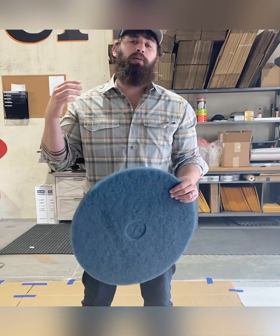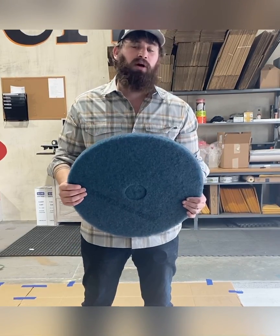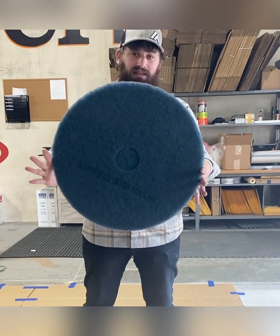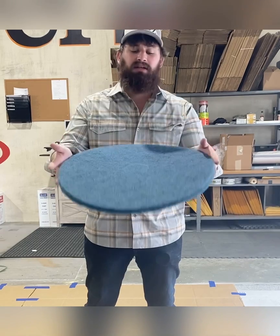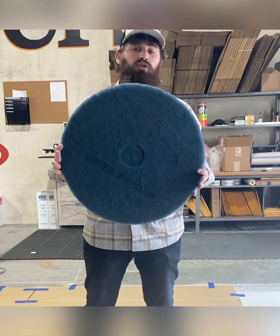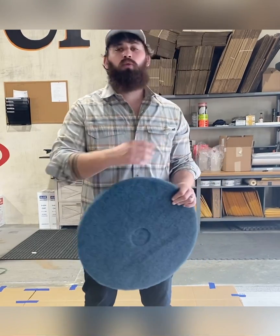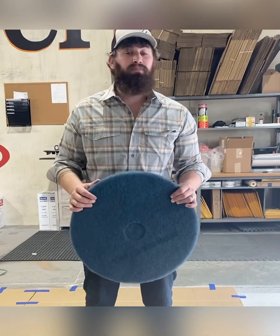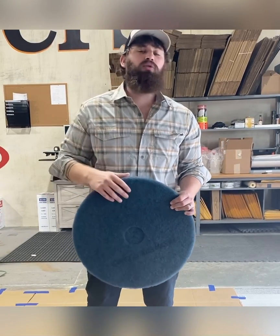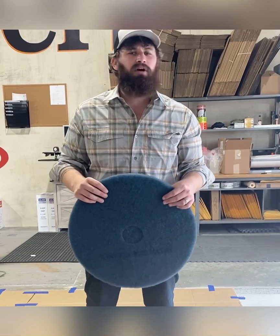So if you go and put our product down over it, you have to stunt that emissions process by cleaning it effectively, okay? If you take this teal blue pad, it still has a little bit of an abrasive tendency, but it's not going to hurt your epoxy, okay? So what you're gonna do is let that critical recoat window close up. Technically, the longer you wait, the better your BallistiX is gonna go down. But we understand that you guys can't always wait, right? You can't tell your customer, hey man, wait 4 or 5 days and I'll come back and top coat it.